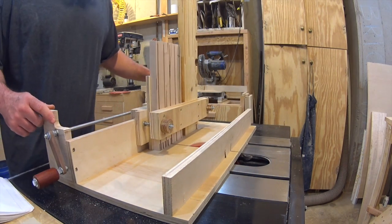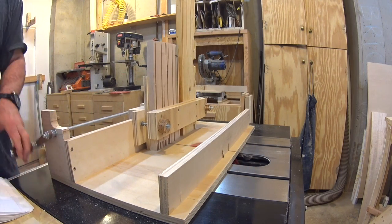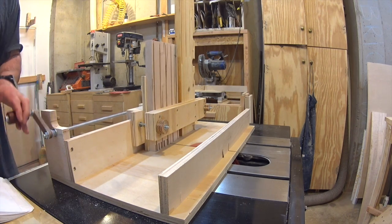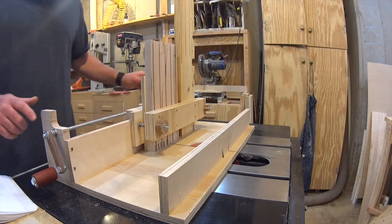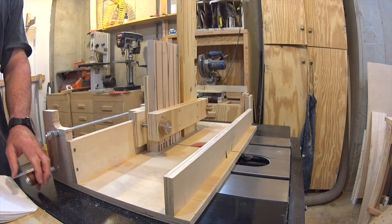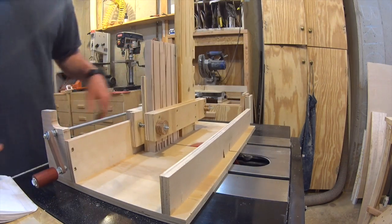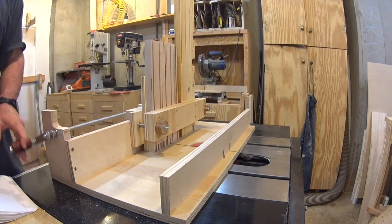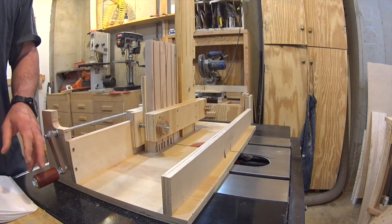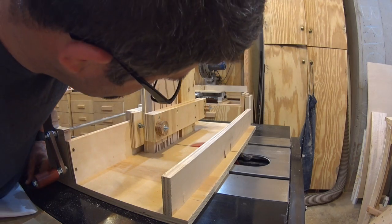If you use a thin kerf blade or a 3/32 kerf, it messes up the math. At least it does for me. Ed Stiles says that different kerfs give you more options. For me, it just gives me a headache and more ways I can mess things up. So I'll just keep it simple and stick to either an 1/8 inch or a 1/4 inch blade. And because of that simplicity, I can do things that look really complex.